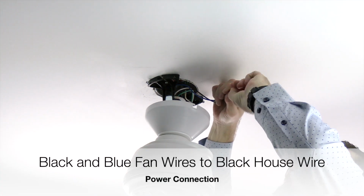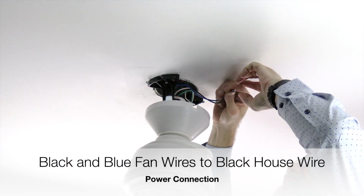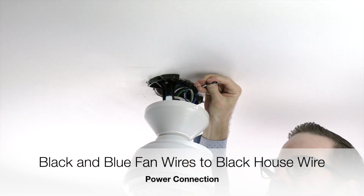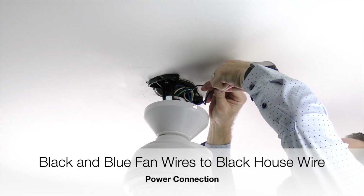Finish the wiring by taking the black and blue wires from the fan and twisting those together. Once those wires are twisted together, twist those wires together with the house black wire. This is the power connection. Secure the connection using a plastic wire nut and a piece of electrical tape.